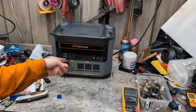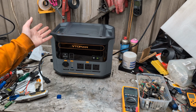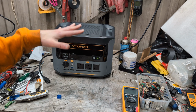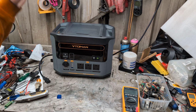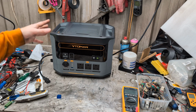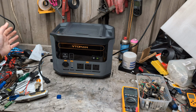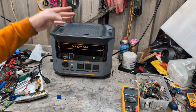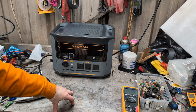There's the dumb kind, which basically just switches over to batteries as soon as the power trips. The second kind has a power regulator, so it takes the voltage that's coming in and tries to make it smooth, and if it goes above or below a certain voltage, then it cuts in and runs on batteries. And then the third kind takes electricity coming in and always runs off the inverter. So no matter what's happening with outside power, you're always getting the clean AC 220, 240. And that's it. I've gone on a UPS style rant here.